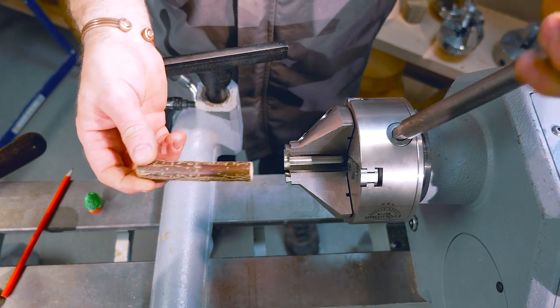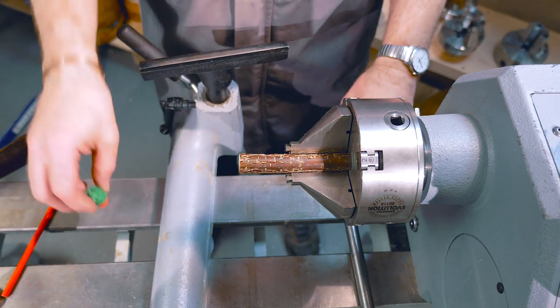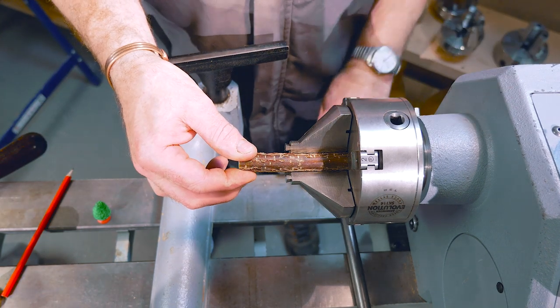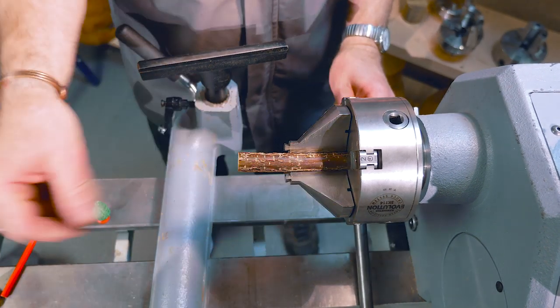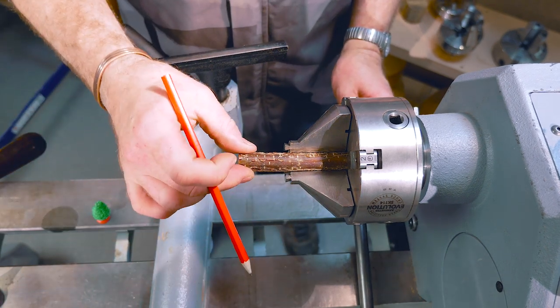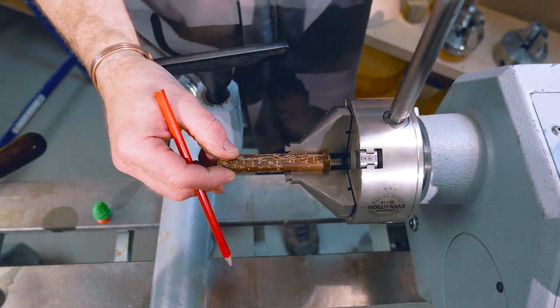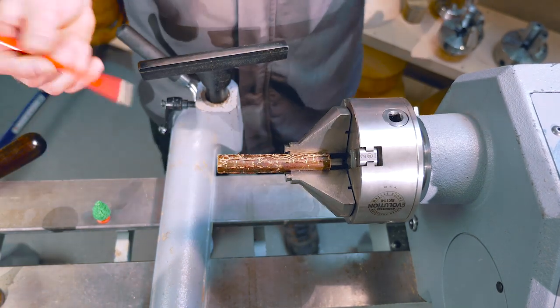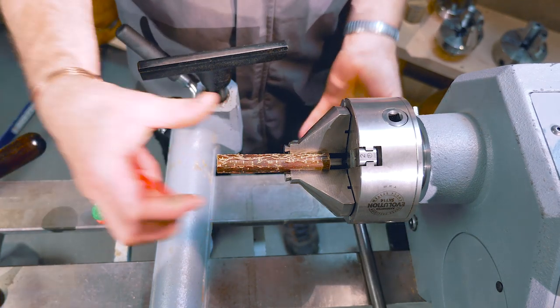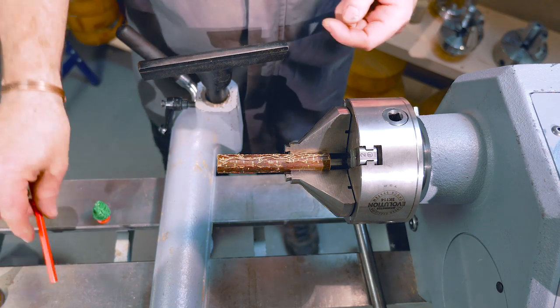Other things we can do: this is hazel, so we want to make something like our small little Christmas trees out of this. We can see how the branch will hold all the way down through there — lots of grip being presented. Nice straight inside puts lots of pressure onto our workpiece. We can obviously feed these out as we want to go through and lock them off. So with round objects, bits of dowel, we can feed all the way through the headstock as long as it will pass through — gives you something quite positive.